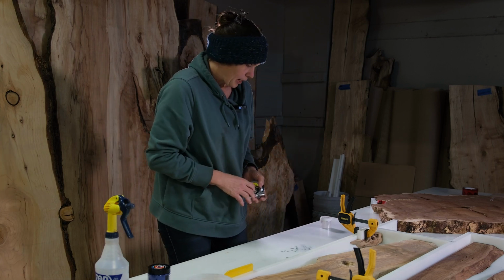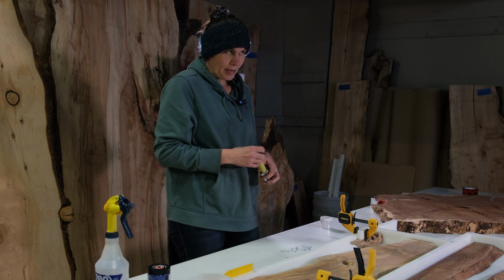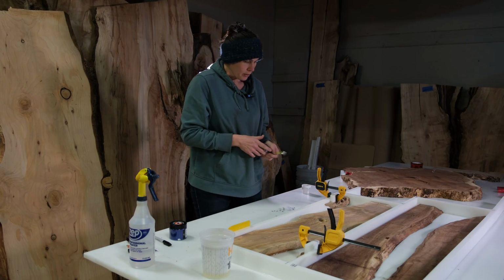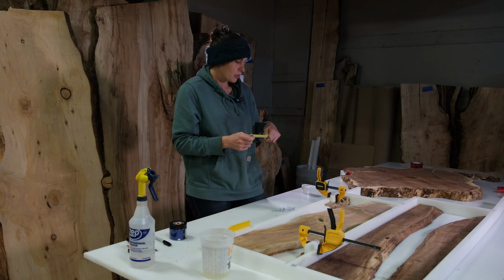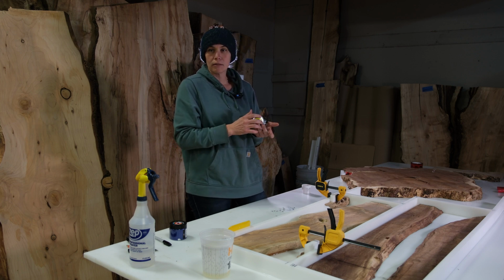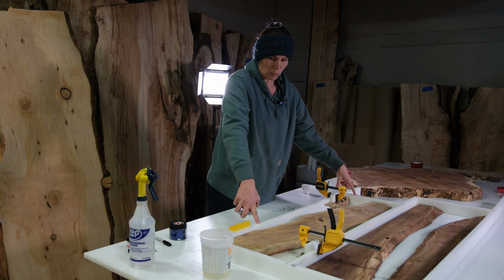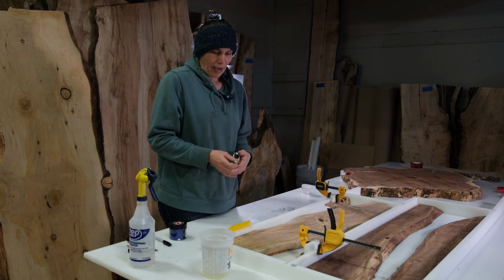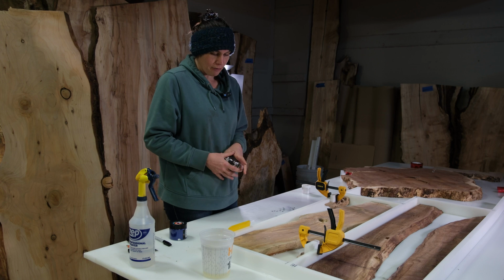And then we're going to take that amount, which is 192 cubic inches, and change that into liters. You can use your calculator. So that is 3.18 liters that will be needed for pouring this side. I did the exact same thing on the other side and got 2.99. So overall it's going to be about 5.